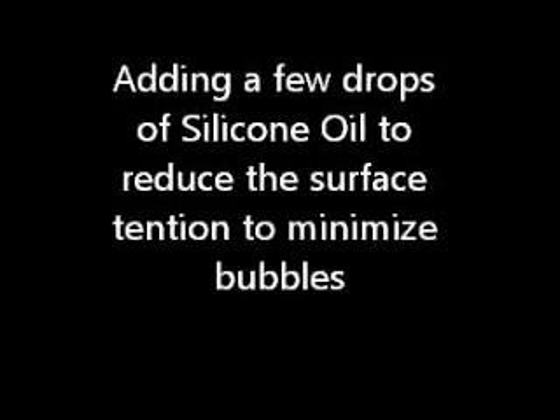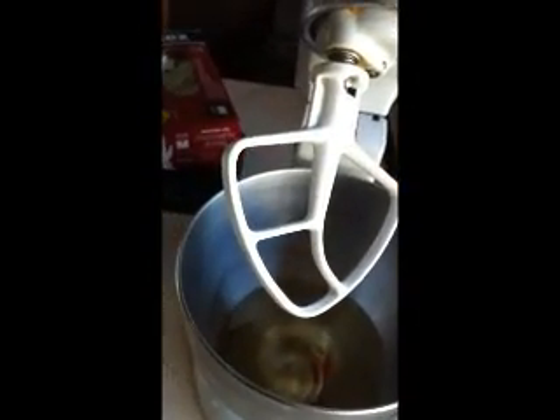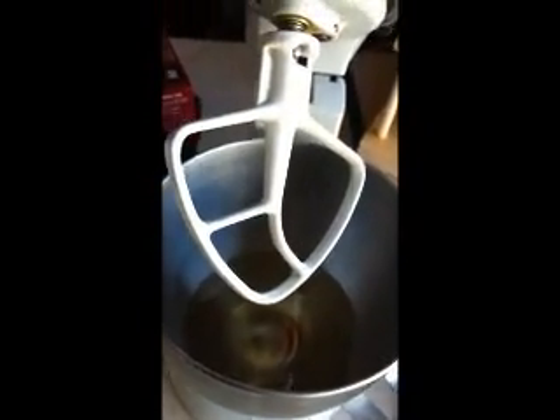I've got my R45 and my Tepanol in the mixer. I'm going to mix this for probably about five or ten minutes. But before I do that, one of the things I'm going to do is add — this batch is 1320 grams — about two drops of silicone oil. What this does is it acts as kind of a defoaming agent; it stops the foaming from happening and keeps down on the amount of air that gets into the mixture. I'm going to go ahead and start this mixing for probably about five or ten minutes to get the Tepanol mixed in well, just at a slow speed.